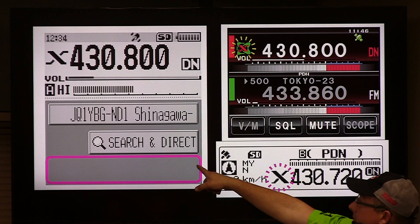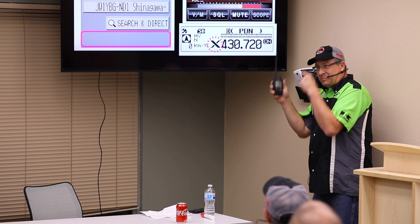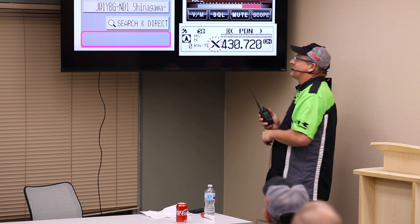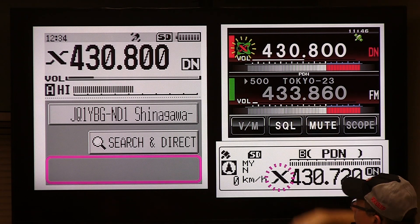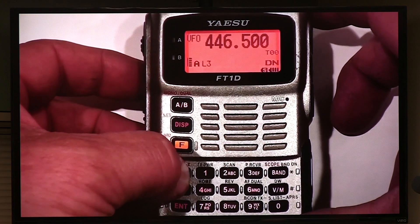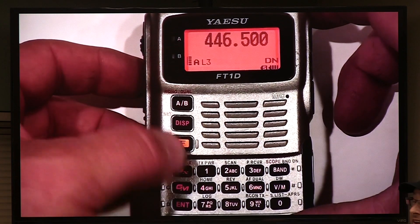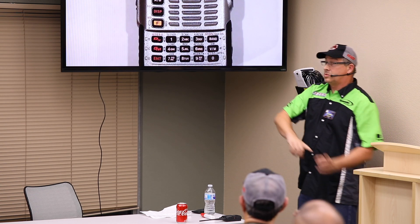There's that X button. The FTM-2D, the FT-100 — once you get everything hooked up and everything is hunky-dory with no weird errors, you've got to press the X button on the radio. I've been reading all the posts on the Yaesu Fusion net on both Yahoo and Facebook, and one of the most common issues is people are not hitting the 'get on the Internet' button. So make sure you hit X — it'll start blinking on your radio. There's the X button. It says 'voice wide,' it's going to switch — it's talking to my node. Boom, I'm now on my computer, my node. From here, this is where I launch out into the rest of the world.